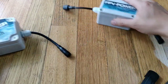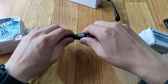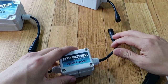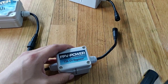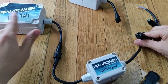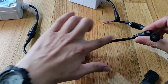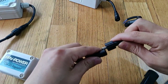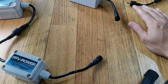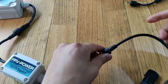Let's just talk about rigging it up. Let's use the small one for space. A lot of people would just plug it in like this. If you're using one fish finder, then this is the right way of doing it. From there you've got a fuse pigtail. Coming in from the battery to the 1.5-amp regulator, this is regulated at constant 12 volts, and you plug your fuse pigtail to your fish finder. If you don't have a fuse, then you plug in the standard pigtail that came with the battery, and that goes to your fish finder.